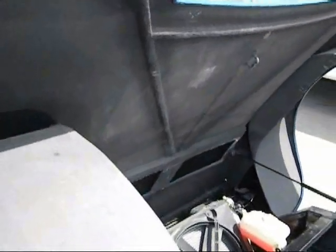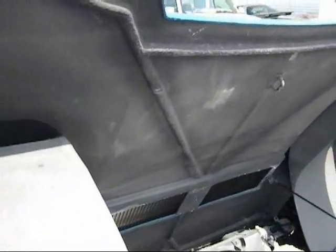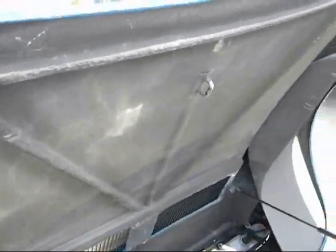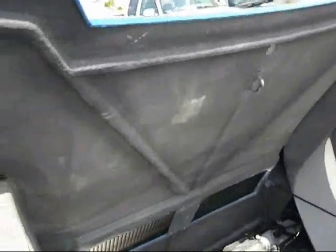We had to kind of do it from pictures and planning and thinking, but the only way we could get the body to stay in place was to wedge it out to where it should be, and then we welded in tubular steel framework. All these ribs that you see here, that's all steel that's fiberglassed right into the underside of the fiberglass body that holds the body in place.